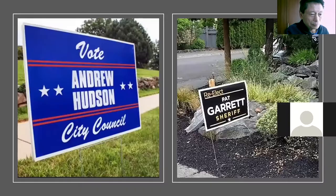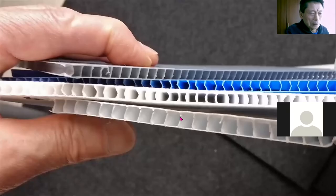To those who may not know what coroplast is — you can see it nowadays as election signs popping up along the roadside. Even though sheets are the same thickness, that doesn't mean they have the same quality. I ordered some samples from China, and for 4mm coroplast it can be very strong depending on what additives they inject into the plastic when they build the sheet. You can also see that the spacing of the channels is different.